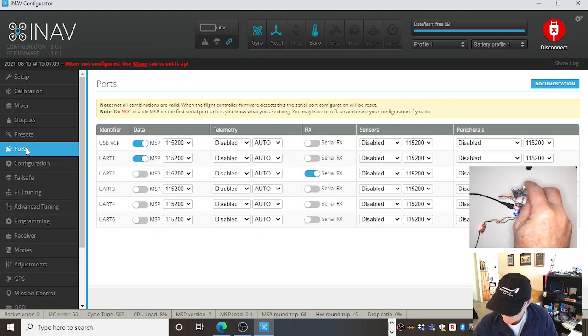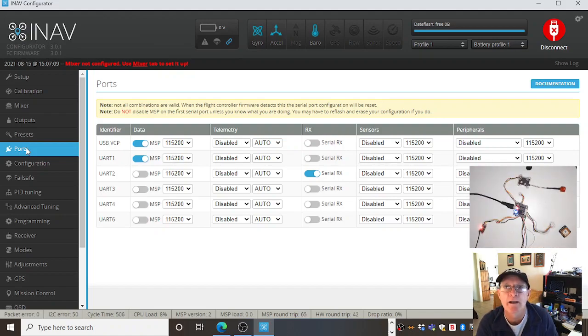you can start talking about things like telemetry and where missions are conducted from the ground control station, like INAV. It's one of the topics in Unit 2, and what telemetry means coming in to your ground control station, and why you'd want information about distance and height. Isn't the drone taking care of all that? You know, location. Well, I suppose it's always good to know where the drone is when you're flying it. It certainly is. And battery information coming back, so you can start monitoring all those parameters associated with the drone.